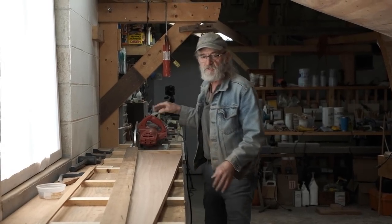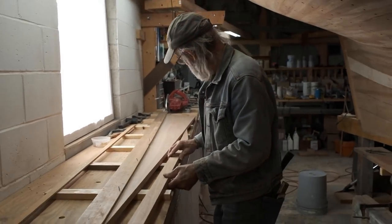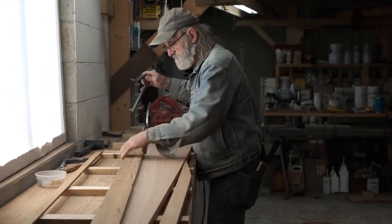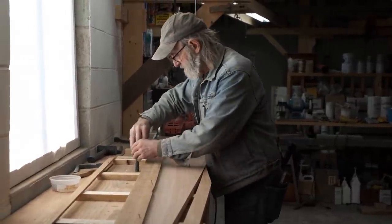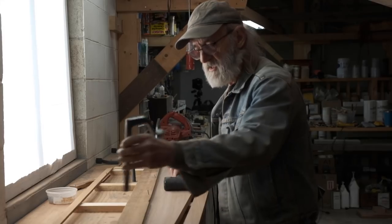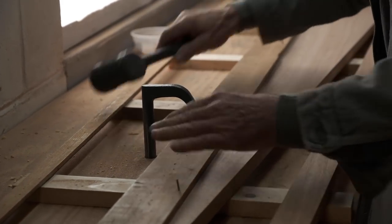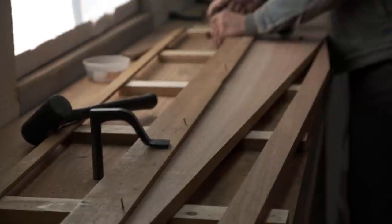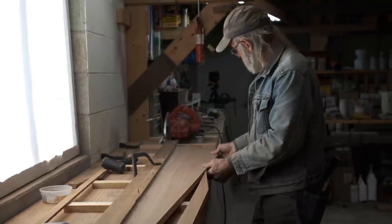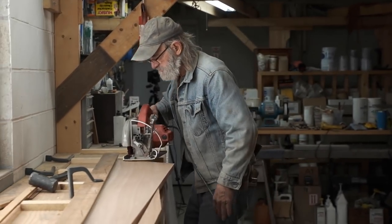The only thing I want to do before I get started is take this little strip of wood and put it right over here to support the saw when I get going. And the other thing I want to do is take hold downs, and we're going to put that right in there and hold that thing right down nice and tight. Now, we can't get them too tight because the pattern's kind of hanging off the side of the stock. So, just like that. I'm actually going to move this one a little tiny bit. And that's it.